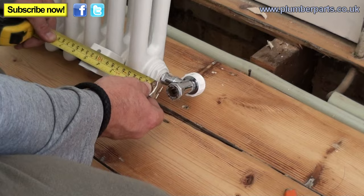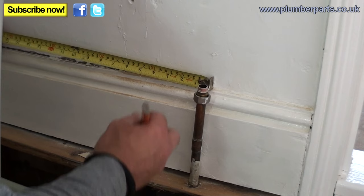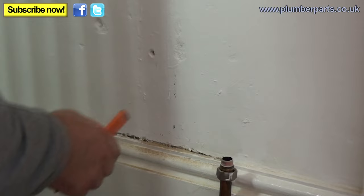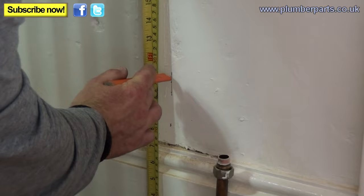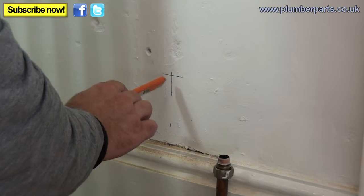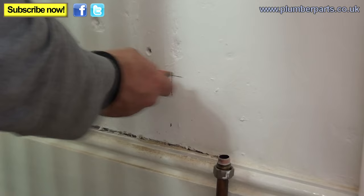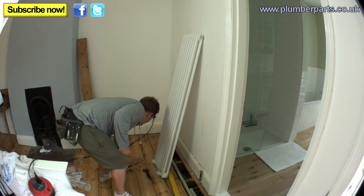Here's the pipe I need to go on — I need my center to be on there. I pop that on there, measure over at 11.2, and Bob's your uncle. I get my spirit level, make sure the bubble is okay, and make a small line just there — now we know where the bracket's going to be. The height I'm going to define — we're going to go at about 28. Grab the spirit level with a nice horizontal line. Now we know where our first bracket's going to be. We measure up from here 143.2 centimeters, make our mark there, make sure the spirit level's in line, then measure across 21.5 centimeters. Make sure they're both leveled, and then check all your levels when finished.